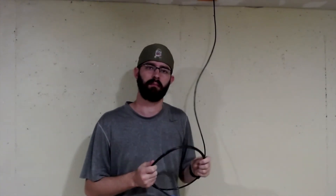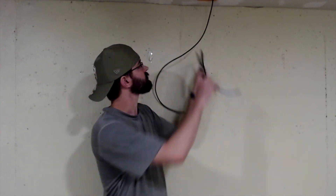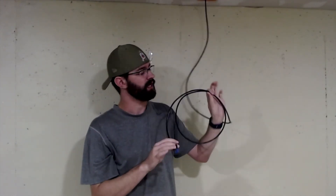In a home, I don't leave that much. What I like to do is leave about eight inches out of the box for working with, and then take a couple of feet and wrap it up and put it behind the box. That way, if there's an issue, I can pull a little out as needed, cut the end off, and redo a new end. I still have some excess in case it needs to be moved or years down the road it becomes damaged. If you leave the exact amount you need, you're not really future-proofing — and I do suggest future-proofing any ethernet cable run, always leaving extra in case it needs to be moved in any direction.